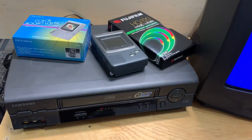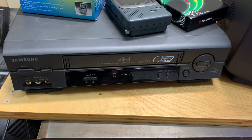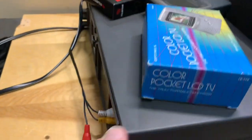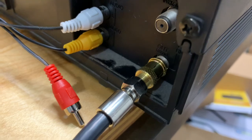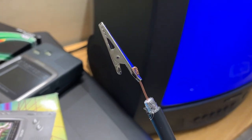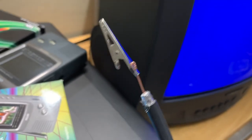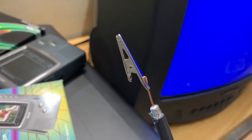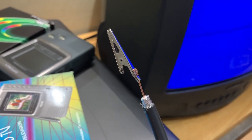To generate an analog TV signal, I've taken an old VCR that I bought at a local thrift store for only $6 — a great deal because it works really well, plays nicely, and it's in great cosmetic condition. I took a piece of coax cable and connected it to the RF out, which modulates to channel 3. On the other end I stripped the coax cable and put an alligator clip on the main conductor, so I can clip this to my portable TV's telescoping antenna to grab the analog TV signal — and avoid broadcasting a wireless RF signal, because that is a big no-no.